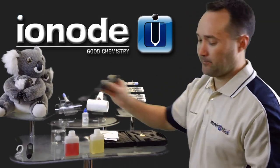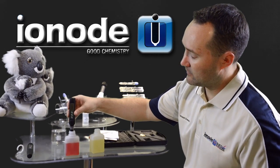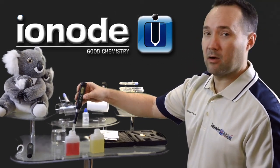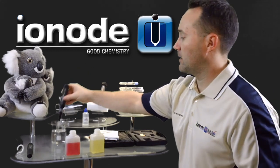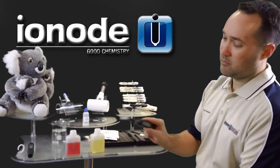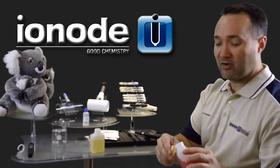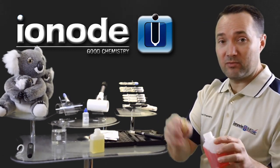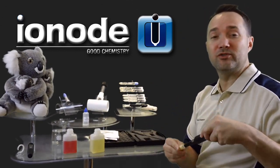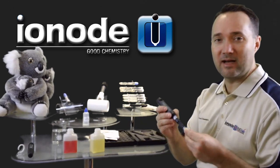Go over here and rinse that off. Go into a pH 4 buffer — and we have 4.0. It took just another second or two to get down to that range. Now, rinse that off and put that away. When you're done, if you've got a little bit of pH 4 buffer left over, you can take a little bit of that buffer, put it in this cap — just a drop or two, not a lot — into the cap and use that as a temporary storage solution for this electrode. Just a couple of drops to keep it in a humid environment inside that storage cap.